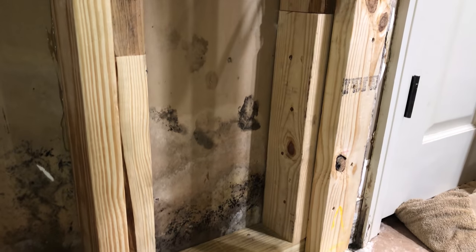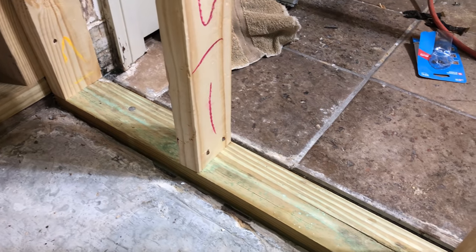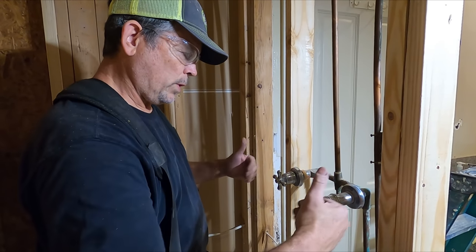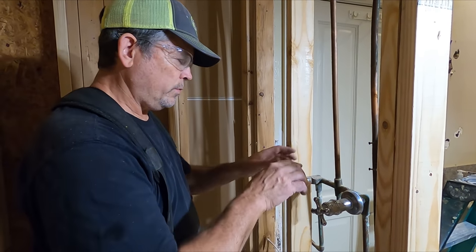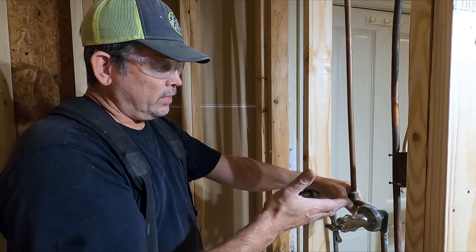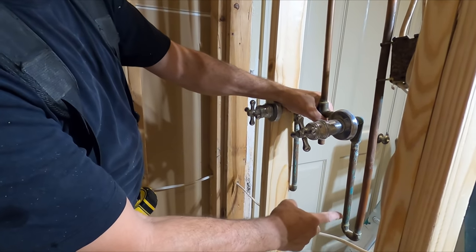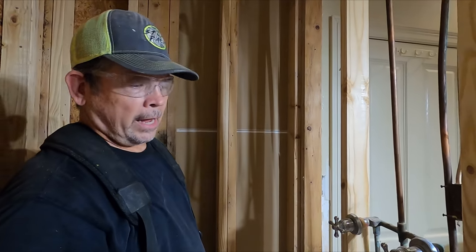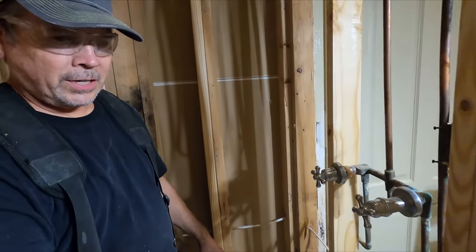We glued it, nailed it, even put in a couple new studs. I bought 16 — I think we used 12 of them. It's amazing how many you use. So the next step is we're going to fix this plumbing. This valve was way too far out, so we're going to move the valve body back. We know it should be a pressure balancing valve, but the owners love this one so we're going to keep it. And we're going to fix the electrical and tear this floor up — that'll be in the next video. The owners decided on a new floor, so for everybody who said it's going to turn into a whole remodel — you were right. That's a wrap guys. If you liked the video, be sure to like it, subscribe if you haven't already, leave us a comment, and we'll see you on the next one.